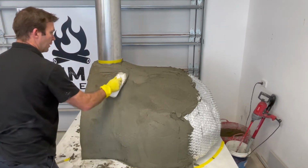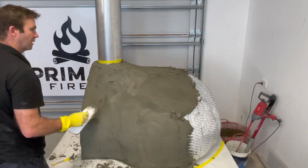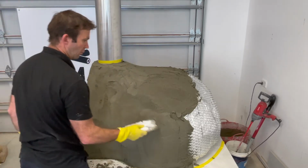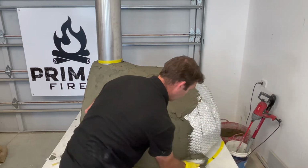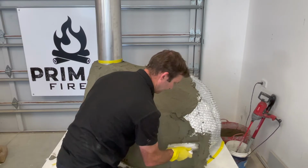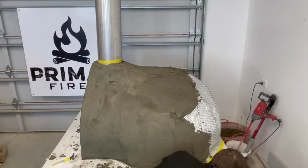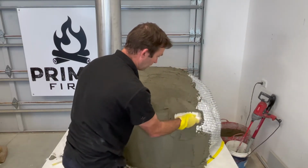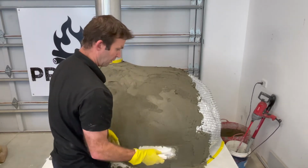And in a minute I'm going to introduce you to the Curvinator 3000. It's basically the DIYer's dream come true when it comes to doing plastering work like this. So just on these sides, boom, spread it up, spread it up. You can see it's not falling off, nothing's happening. I'm not doing anything special because we've got our mix right. If we put too much water in there, it'd be absolutely hopeless, it would just be falling off. If we didn't put enough, it wouldn't be workable.